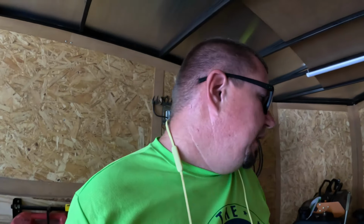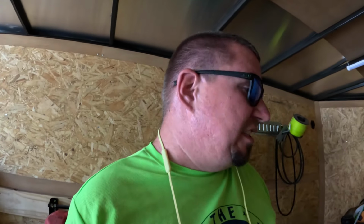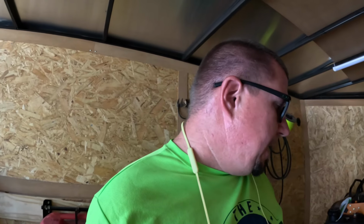So first things first, as far as actual cut quality goes, before it would kind of be bushy and shaggy and leave a little bit of stragglers. The cut quality is way better with the extreme high lift blades. You still can't go full deck width. When I was mowing deck to deck, instead of overlapping a little bit, it would still leave a little mohawk section next to the deck. So you still have to overlap a couple inches to get this thing to cut everything.